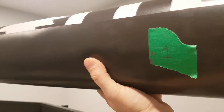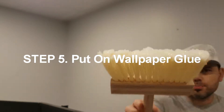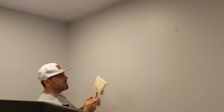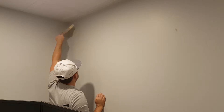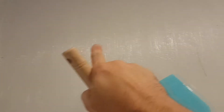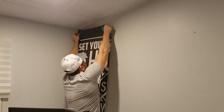Because it's already cut, we're going to assume it goes straight up. As a finish, we're going to put caulking at the very top. Grab your number one strip, take your brush and the glue. You want only a little bit on the brush as you spread it — just make sure you cover the entire surface from top to bottom. Apply it up and down. You'll see long streaks — make sure you get all the edges. You have about a half-hour working window so you don't have to rush. Grab your squeegee and your roll, and start from the very top.